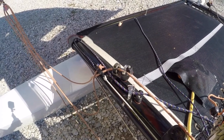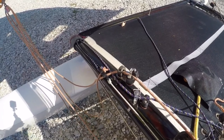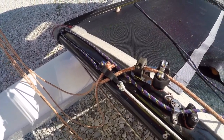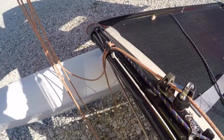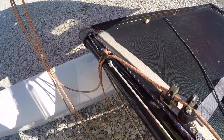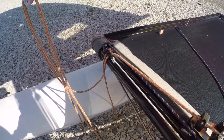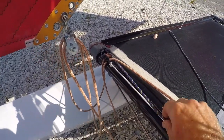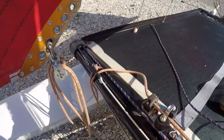Also, especially if you have an older Hobie 16, you might want to consider upgrading your jib system — the way that the jib sheets work. I've seen quite a lot of old Hobie 16s where the jib cars just move by lifting a plunger, sliding it across, and then it's in the new position. With the modern Hobie 16s, the jib system uses a pulley so you can actually adjust where the jib car is while you're out on the trapeze, which is very good and well worth the upgrade.